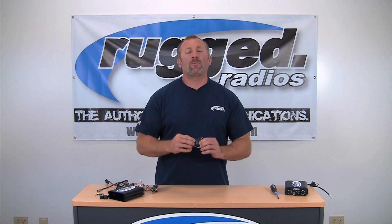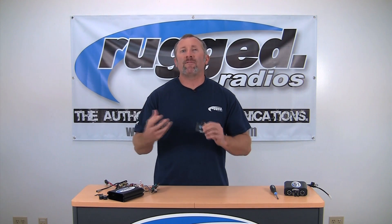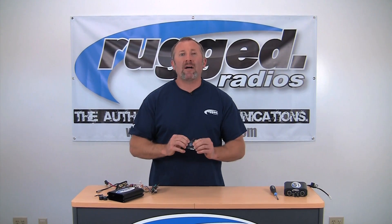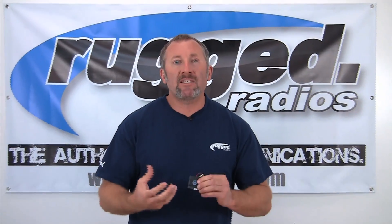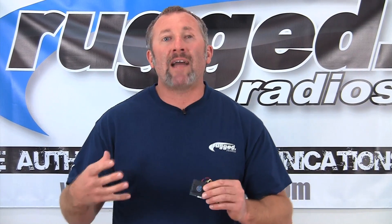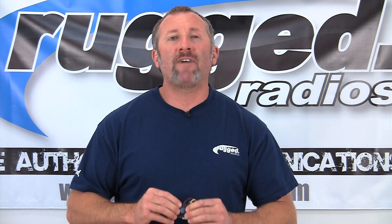For the first time when you hear it, when you're testing in a very quiet environment, you might hear a little echo factor. Sometimes you'll hear a little echo of the DSP — that's the processor trying to sample noise. If the only noise you're testing with is your voice, you're going to have some echo. Once you get into a loud environment and it's sensing the loud noise and the frequencies we want to cancel out, then that echo factor goes away.